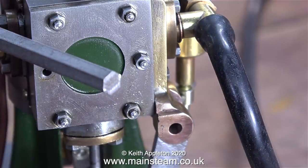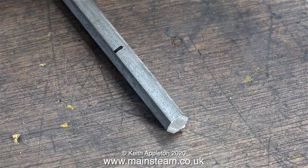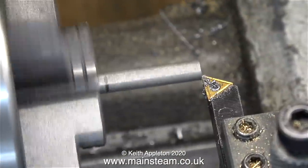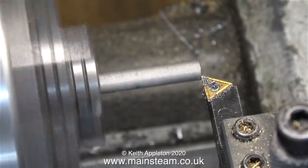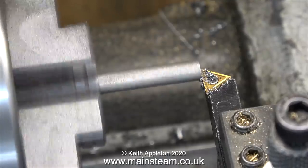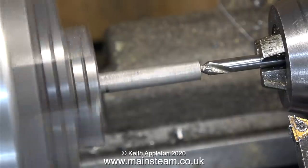To make the new stud I'm going to use this piece of stainless steel hexagon bar. I drew a line on it using a felt-tip marker — this is only an approximate mark but it shows me how far to turn the part into the three-jaw chuck in the old Boxford. Then a quick face across the end of it. As this hexagon bar is stainless steel I keep the tool moving at all times, and I also do this when drilling the end of it.